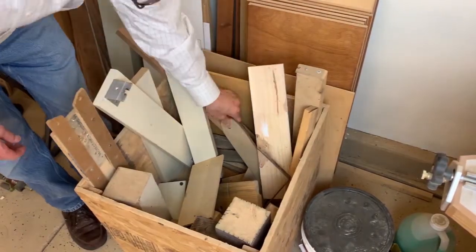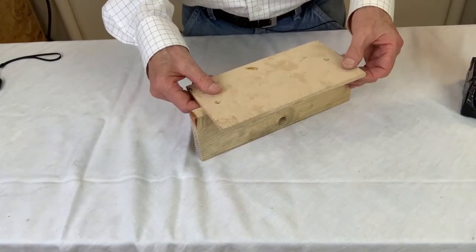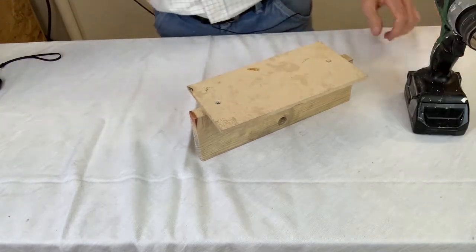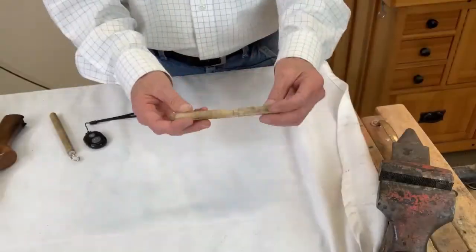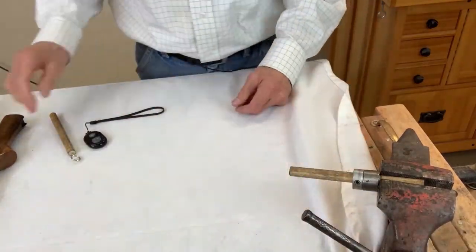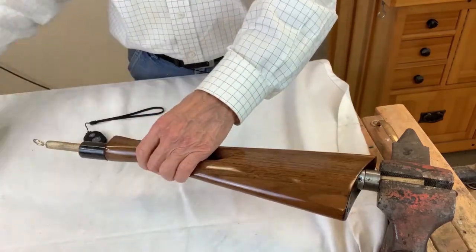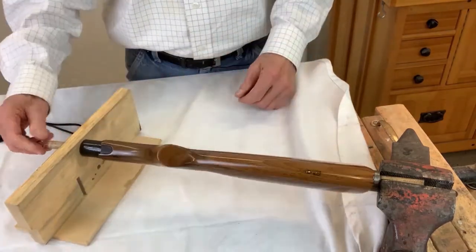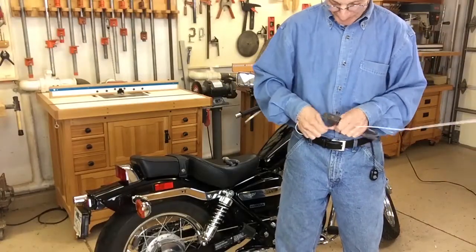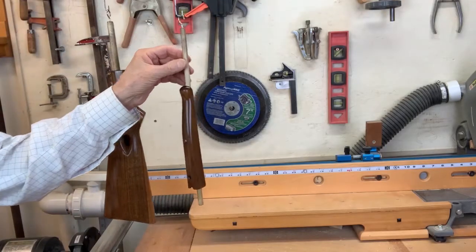Before applying the finish, I wanted to throw together a cradle to allow me to elevate and spin the stock horizontally. A couple of pieces of scrap and a few half-inch dowels did the trick. Adding a hook in the end of the dowels gave me a handle and a way of hanging the stock for drying. These were spacers I just happened to have laying around, but you can cut spacers out of half-inch PVC pipe. Over the years, I can't tell you how many wire hangers I have repurposed for hanging materials to my fluorescent fixtures to dry.